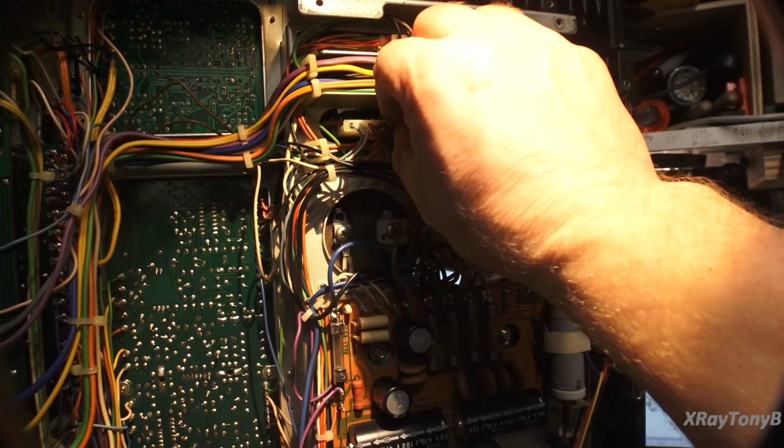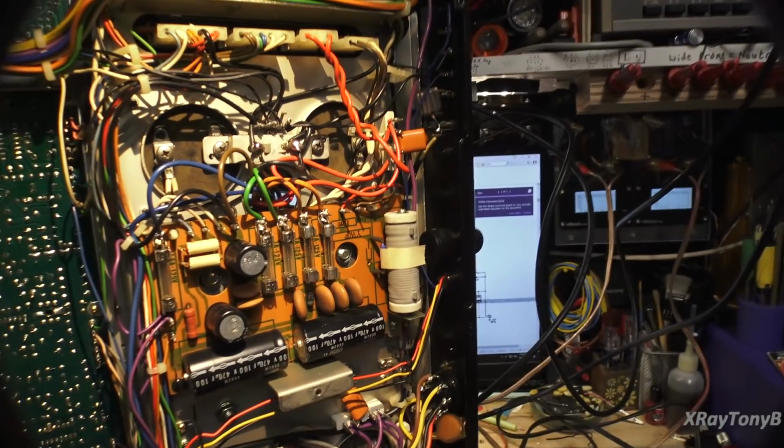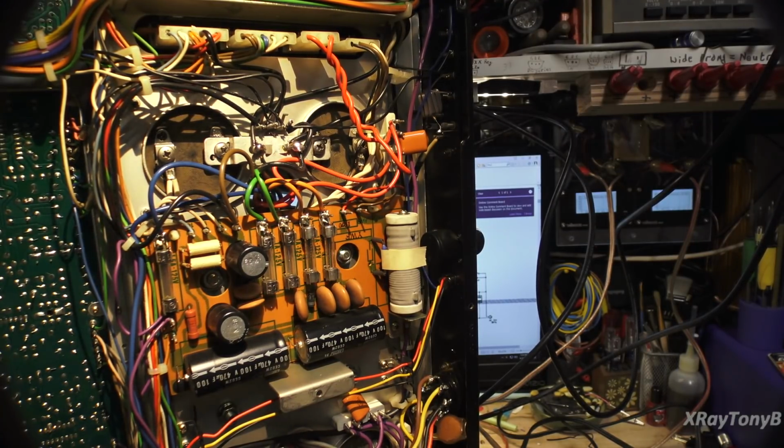As you can see, everything's connected with plugs, easy to take apart. There is your soft start resistor right there, and your little thermal fuse. I always find it funny that they tape it together with masking tape. That's factory. That's how they do it. But this is the big ceramic resistor, and it is 3.3 ohms. I actually have a spare one here I was looking at, and it is 3.3 ohms at 20 watts or 50 watts or something like that.